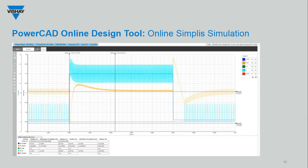And this is what you get with constant on-time topology, pseudo fixed switching frequency. In power save mode, it would increase the switching frequency at full load. And when you come back down to 0 or 0.1 in this case, you will reduce the switching frequency into diode emulation mode. That does two things. It gives you instantaneous power far quicker than it would without constant on-time, but it also gives you the efficiency at light loads and maximum efficiency at full load as well.